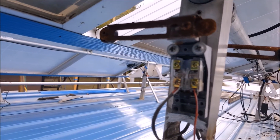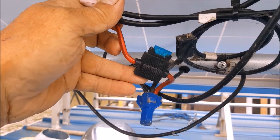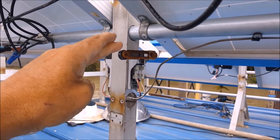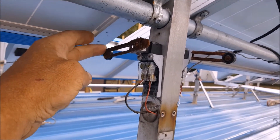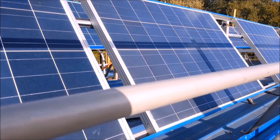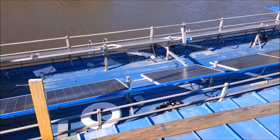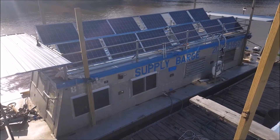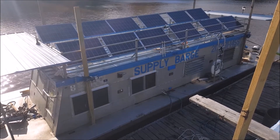Here you see the limit switch with a little wheel on the end. There's a diode at the bottom — black with a silver band. You need diodes on these so when the limit switch trips, it will allow a path for the motor to reverse in the morning to reposition the panels. When the panels tilt as far as they should go before damaging the drive motor, the panel frame hits the little wheel and they instantly stop. These are adjustable in most any direction. I ruined some of the controllers until I figured out these switches and added the diode, even though the wiring is the same doorbell wire with a red, white, and brown covering.